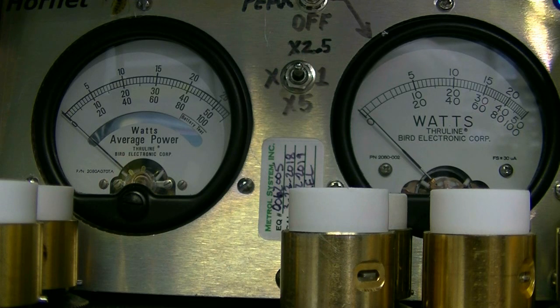Now let's go to sideband. Power's all the way back up. Audio test... a little over 40 watts RMS and over 80 watts peak. Now turning power all the way down — I can get it down to about 20 watts peak audio, which is about 15 to 16 watts RMS. So you should be able to set it anywhere you want it.